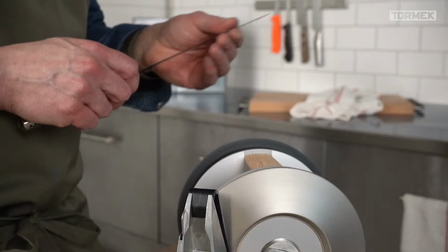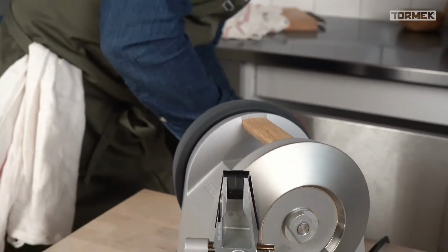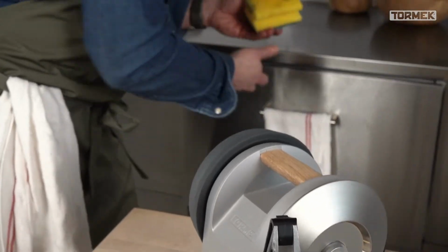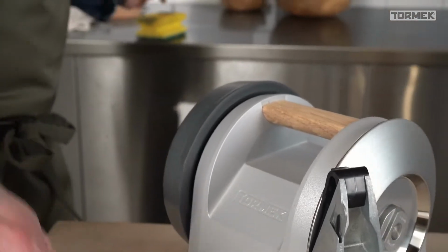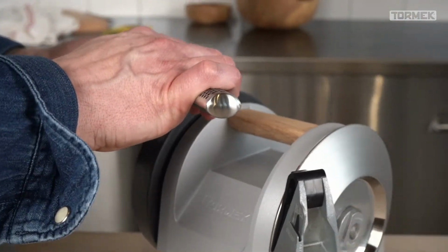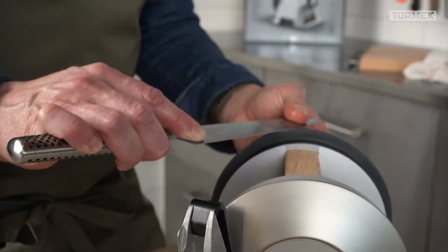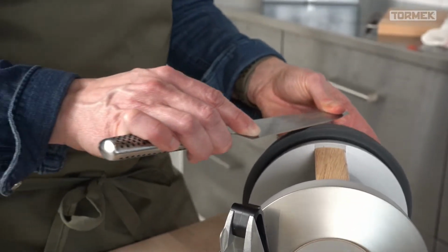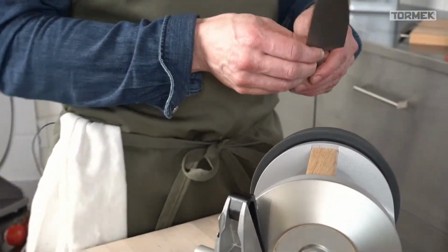We had a question about moistening the honing wheel, right? So I can show you how that's done. You can use a sponge or a cloth or whatever and add some water. And what happens then, it gets super smooth and you get a completely different feel and also a more polishing result. Great. Okay. Thank you, Samuel.